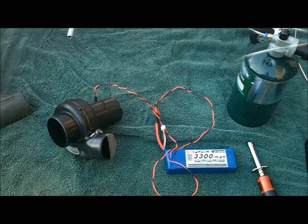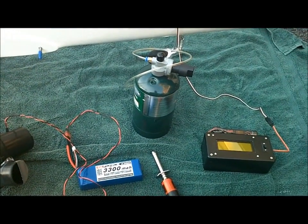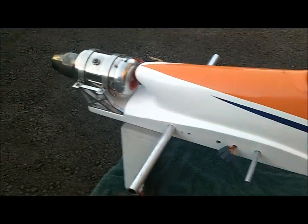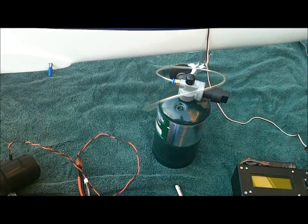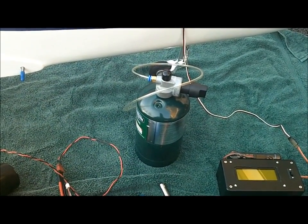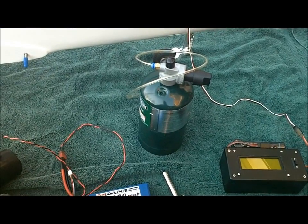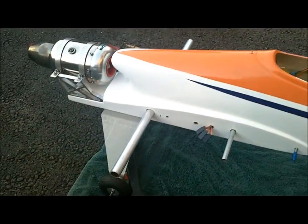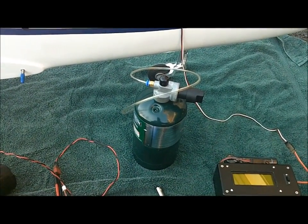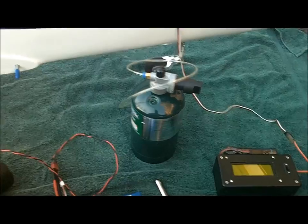The starting procedure is the same as an ECU is going to do it. We're going to use the blower to start to spin the turbine with the glow driver on. We're going to pull the air away a little bit, introduce a little propane, and hope for ignition. Once we get ignition, we put more air on the engine. We turn up the propane slowly.